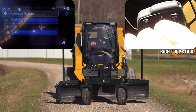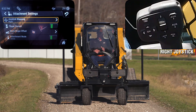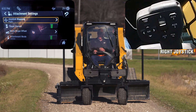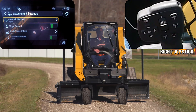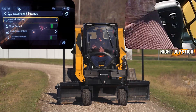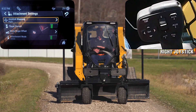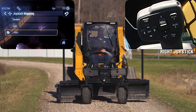I can also select right. How this actually operates is: once left or right is selected, I will have control of one cylinder — currently the right cylinder. The left cylinder, when assist mode is on, will be maintaining the assist function that I've asked for. So if I'm wanting to run a crown of four percent, five percent, or three percent, I can be getting all my material with the right joystick, and then the left cylinder will actually be maintaining that grade.